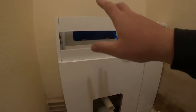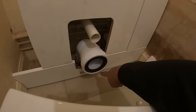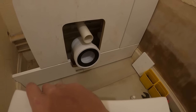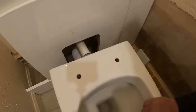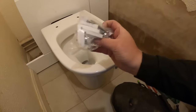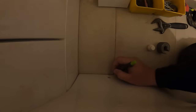Water's on to the system now — filled it up, it's all fine, it's not leaking. We've trimmed these down, we've got the plinth in place, and a little bracing bar on the bottom of the plinth just because we had to cut it in the centre to get either end tucked in with the two bits of skirt — but the pan's going to cover that anyway. What I'm going to do now is test fit the pan into position again, draw around it, and then mark out the floor brackets. With that pushed into position, we've got our marks — it's bang on in the centre.